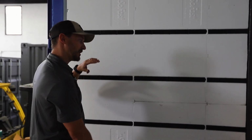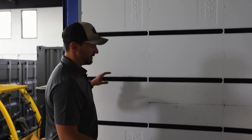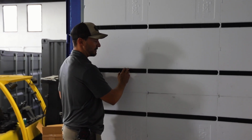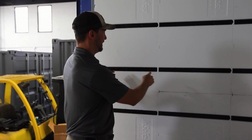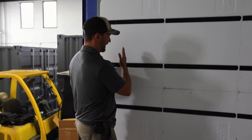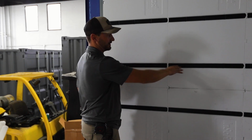Yeah, so if this is the first time you're using this product, you have that tendency to automatically think of 16-on center running vertically. And typically, in any regular construction, that's how you're gonna find it. But because these have those composite studs built into them, and really the point of adhesion we need is that stud making contact with the metal, and the metal corrugated is only landing vertically wherever it is on the container. That's why we're running these horizontal.